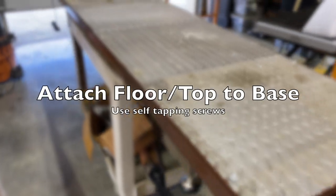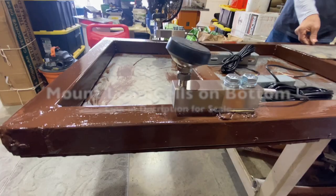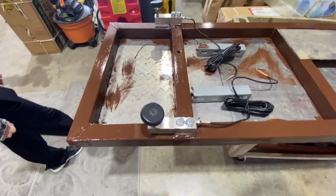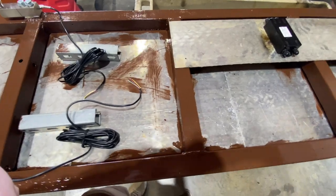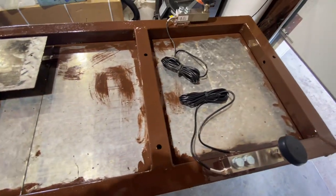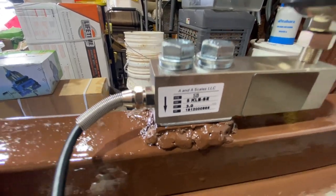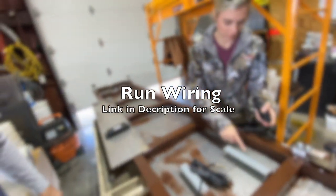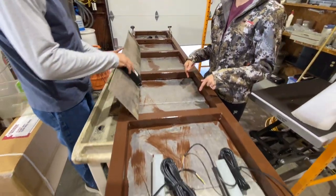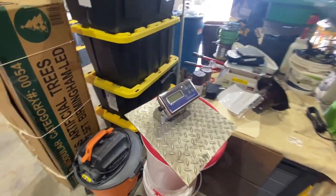It's pretty awesome — we're going to attach the floor we just cut on top of our frame as a good foundation. Next, you want to mount your load cells. They come with welding plates that have screw holes. You can see the load cells already mounted — we welded those plates on and used the bolts that came with it to attach them to the base. The really long wiring needs to be run to the junction box. What we did is drill holes in the frame and run the wires from the load cells to the junction box, and then from the junction box to the digital scale.